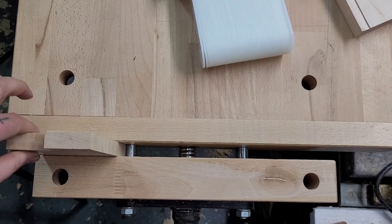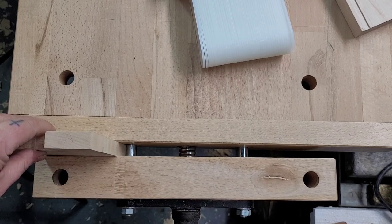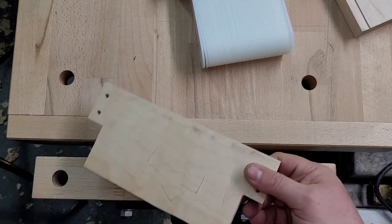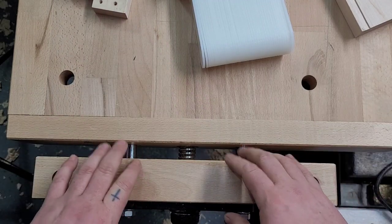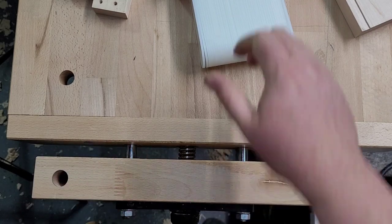It's secure on this side, but watch — this side goes in and you can see it's pinching like this. You don't want that to happen because it's not going to hold your workpiece as well, and it can mess up your vice hardware. Not all vices do it — it seems to be with cheaper vices they tend to rack more, and this is a cheap vice.